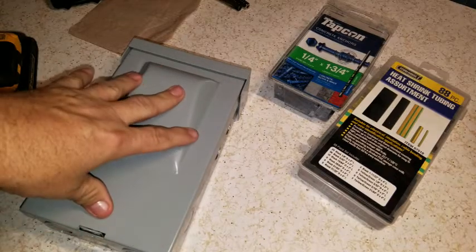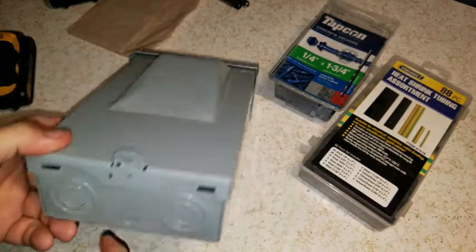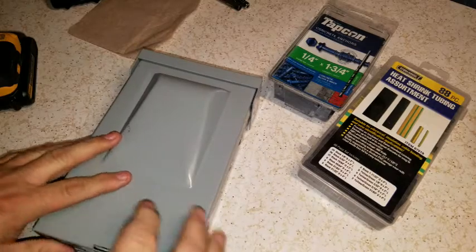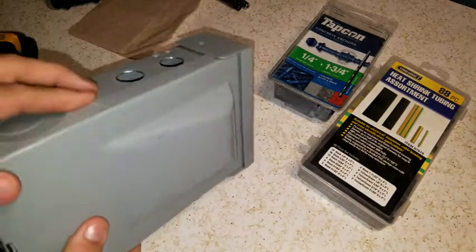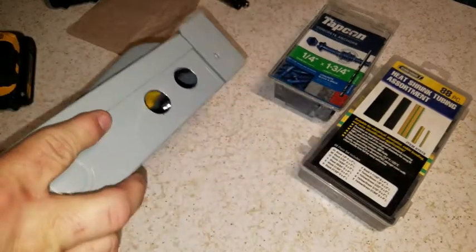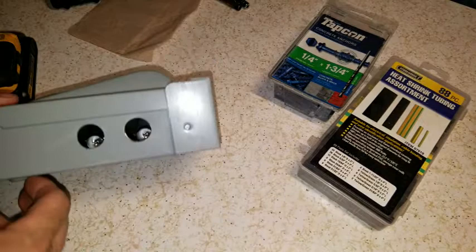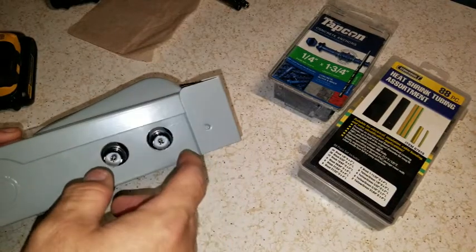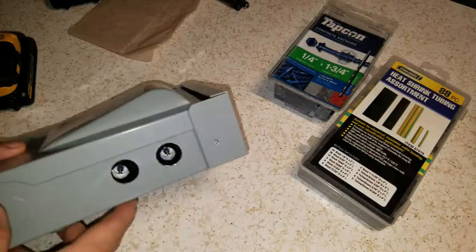I took an air conditioner service box. I'm going to do this little knockout here and run the ground wires out of it. I drilled holes in the sides, as you saw in the pictures — that's where the coax goes in — and then I'll put in rubber corks, slice them so I can keep it sealed relative.